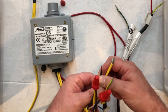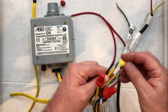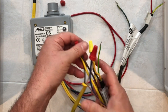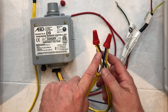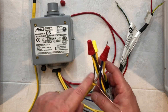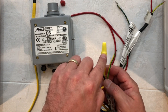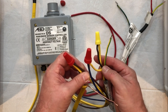And our second dry contact wire is going to go to the second wire from our warm-up mat, so we're going to put those two together to complete our circuit for that first mat. So our first circuit breaker lead goes to the brown wire and one yellow. Our second lead wire goes with the blue wire from the controller and our first lead wire from the mat. And then the second yellow coming out of the controller goes to the second wire from our mat — the first mat that we've wired. That completes one of the mats' wiring.